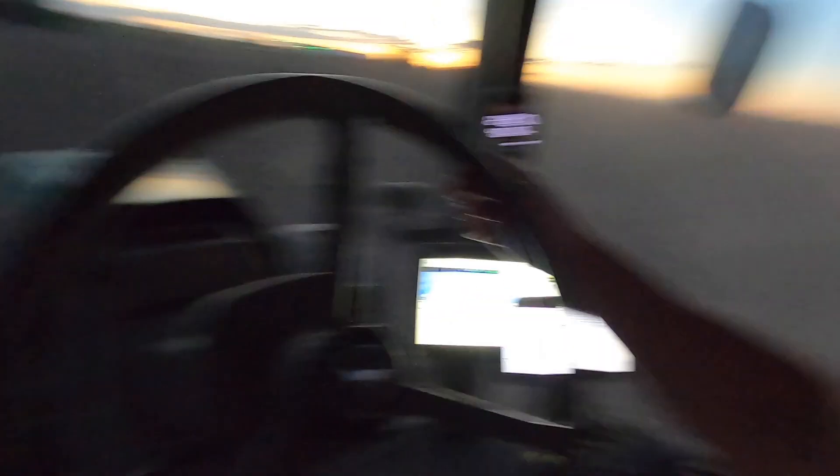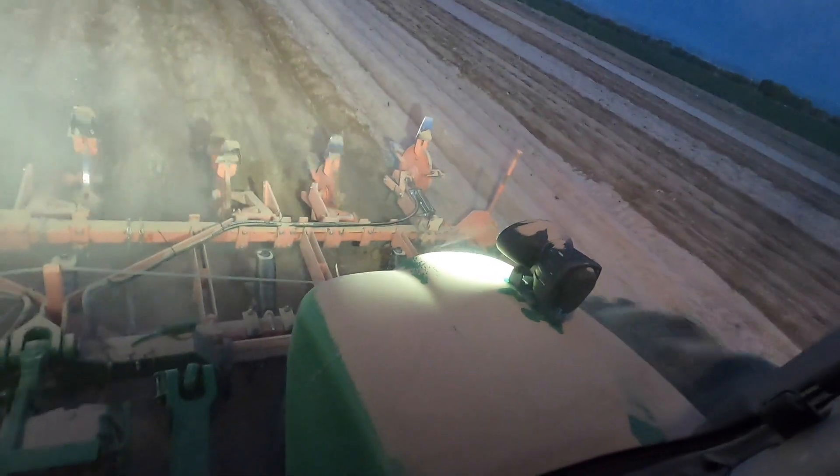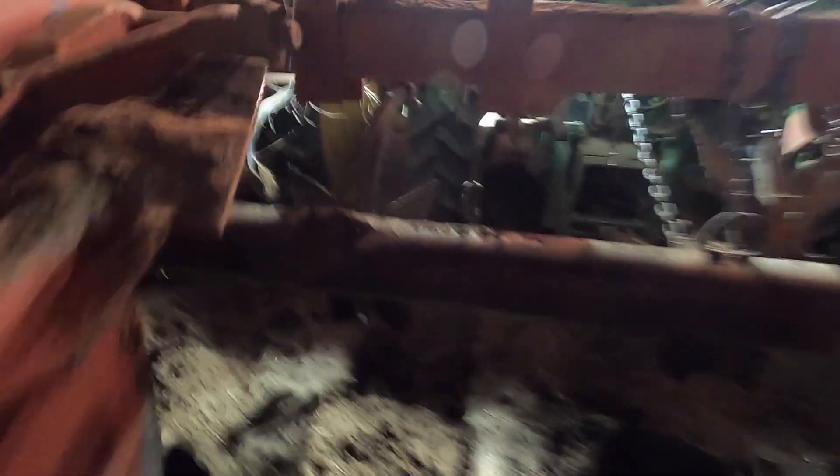Let's light her up. That wasn't quite as satisfying as I was hoping — the lighting definitely is not working. There's a lot back there, I need to see up here. They're pointing pretty much straight out — my implements should be pointing pretty much straight down. Simple logic — I need to make them point down. Yeah, that's much better, big difference. That center shovel is raising up on the shank — we'll walk over and move it back into place.